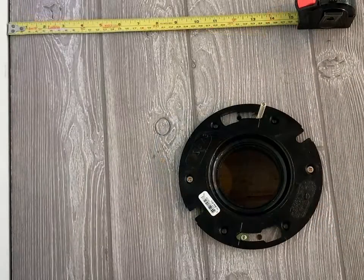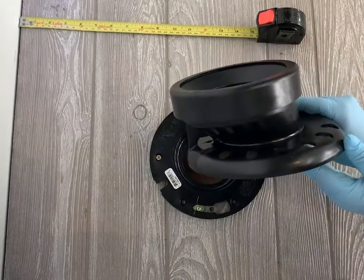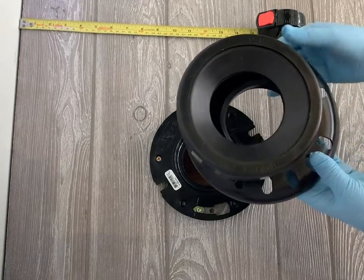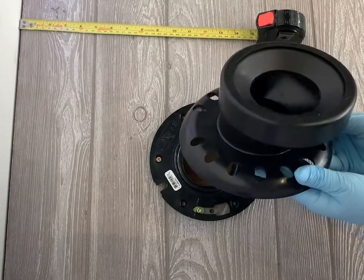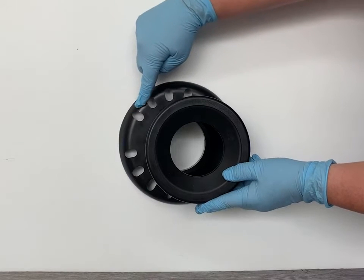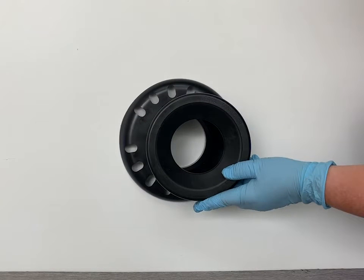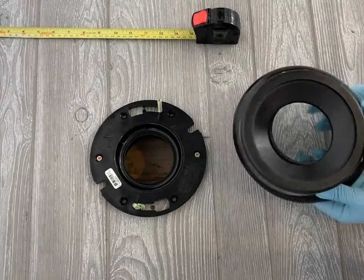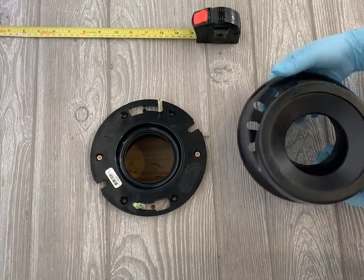The first step is to determine if you have a 10 inch or 12 inch rough-in. Simply measure from the wall to the center of the rough-in. For a 12 inch rough-in, install the adapter with the wider side facing away from the wall. For a 10 inch rough-in, install it so the wider side is facing towards the wall. These holes around the outside give you even more flexibility — if you need a little more room due to thick molding or plumbing that's just a bit off, you can turn the adapter to allow for this. So if you have, say, a 10 and a half inch rough-in, not to worry — Smart Connect will still work.